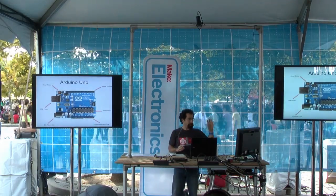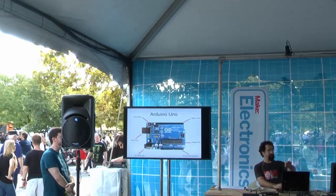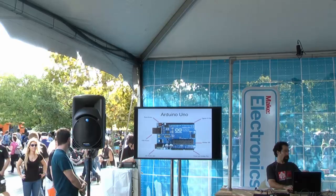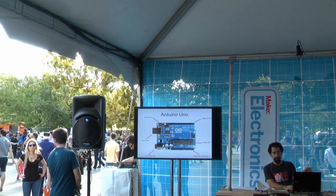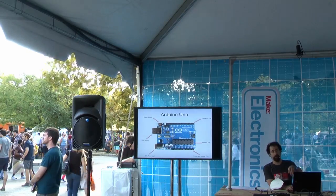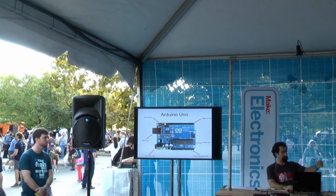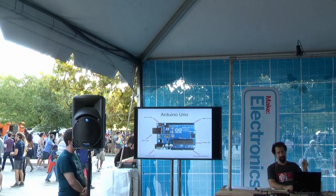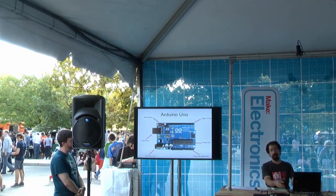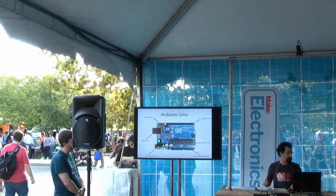Here's the basic Arduino Uno board. You have your reset button. On the top are those digital I/O pins. The long chip is the brain. On the bottom are the analog pins as well as power pins where you can tap into the power rail. You also have USB — both for programming the board and for power — as well as a DC power jack. You can power it from your computer while working on it, then run it off batteries or a wall jack later.